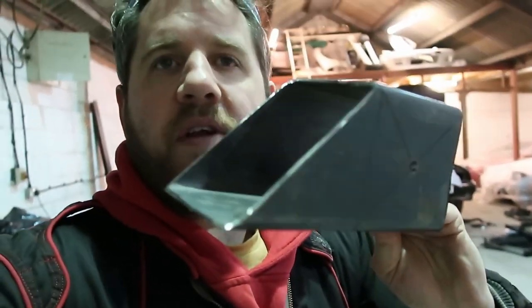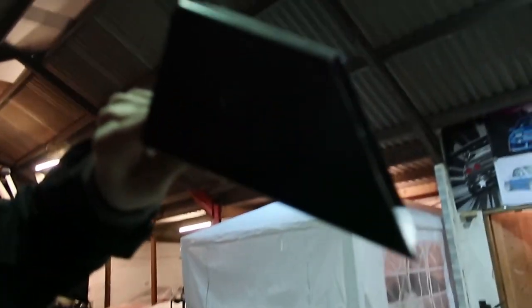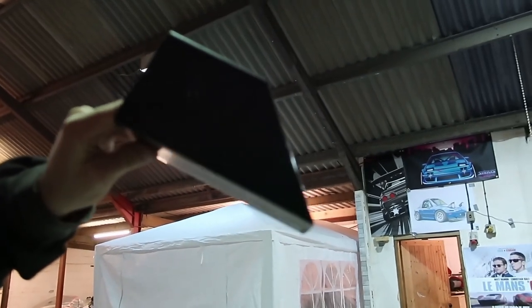Okay, so what we've created is a bit of metal that looks something like this. 45 degree angle, which is going to go onto our base plate and hold it up at the angle we need. I've also put a hole through it, so that when the wood goes through, a bolt can go through there as well and just hold that in place, if you can see that. With the light, nope. There you go. Just put a hole through both sides on there, so we just whack a bolt all the way through.